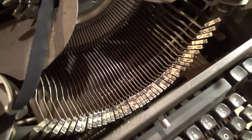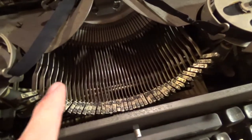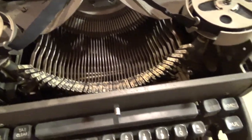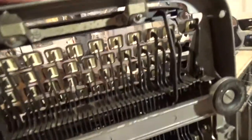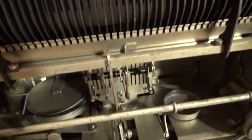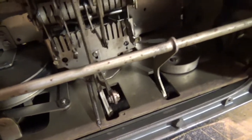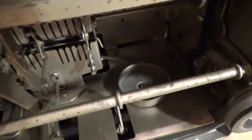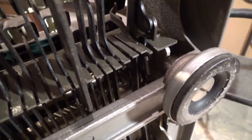The beauty in an old typewriter, in my personal opinion, isn't just the elegant row of keys or striking arms. It's the simple construction that if you really wanted to, you could work on this thing with nothing more than a screwdriver and a pair of tweezers maybe. Everything is mechanical. There's the bell back there, the bell striker, for when the carriage reaches the end. When you're buying these old typewriters, you want to make sure all the springs are intact — and they are on this one.